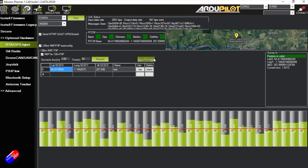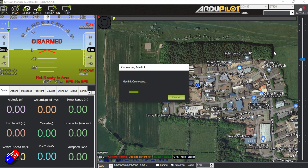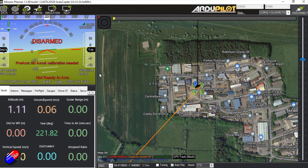It's just about to hit sub two meter — which it has now — and in order for the position to be valid we must also satisfy the time requirement of 60 seconds, which is coming up. We now have a valid base position, so we can save the current base position — we'll just call it 'test' — and now we can use this position to start transmitting corrections. Clicking 'Use' and connecting to the vehicle on COM32, it's now transmitting corrections. We should see the normal 3D fix change to a float and then an RTK fix. We've got an RTK float — and now instantly RTK fix. These F9Ps are very good GPS and very quick to attain an RTK fix — that was seconds in this case.